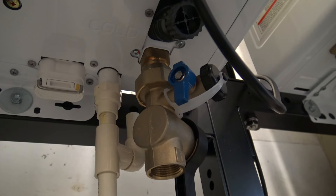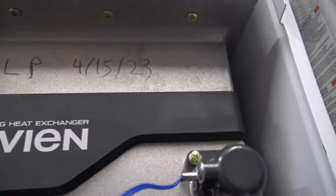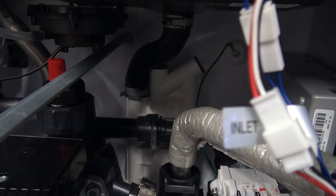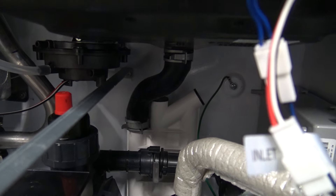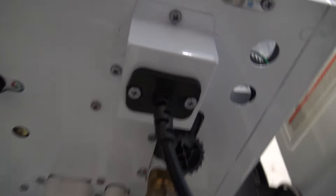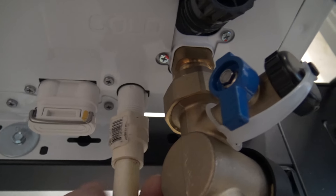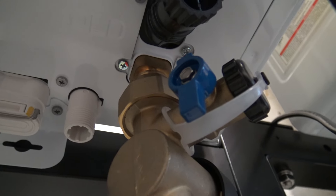That's the way that T is supposed to look — put it towards the back so it's away from the cold water inlet, then a pipe down, and that's what would vent. There's your condensate trap back there again — that white fitting, there's the rubber tube, kind of looks like an S, back down out of it. And this here is a half-inch plastic male fitting that will have a black plastic cap on it.